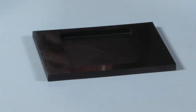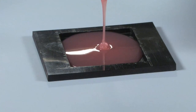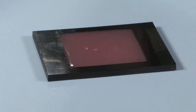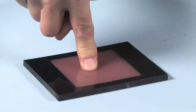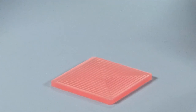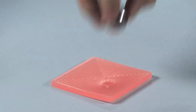Here is the condensation cure. We pour the liquid into the mold, let it settle, let the air bubbles rise out and pop, and then it's ready to cure. The next morning, it's no longer a liquid — it's now a bouncy, viscoelastic solid. While the viscoelastic silicone rubber shown here is relatively firm, each of the three curing techniques offers a wide range of stiffnesses, from very soft to very hard, and a wide range of response times, from very fast to very slow. Here's that same piece removed from its mold: it's bouncy and resilient on impact, but it gradually deforms under steady pressure, and when you stop pushing, it gradually returns to its original shape.